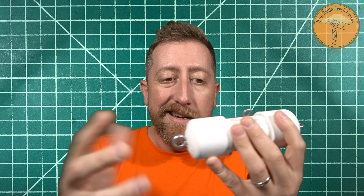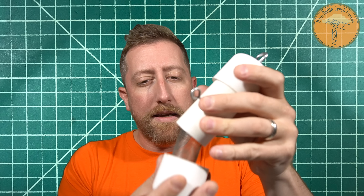This is a slinky dipole. When you open it up, everybody knows it's a slinky. The minimum recommended height for this off the ground is 5 to 8 feet.